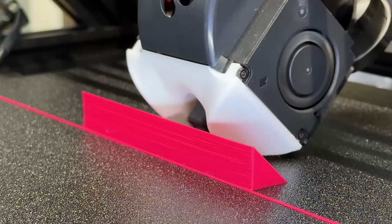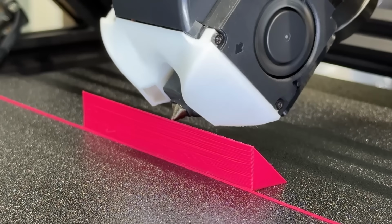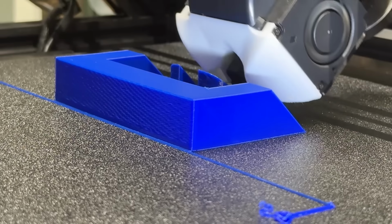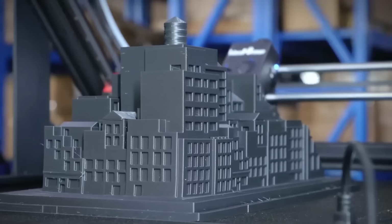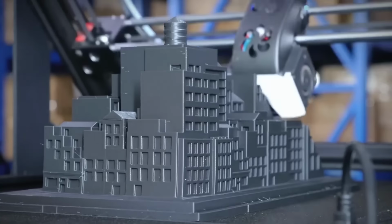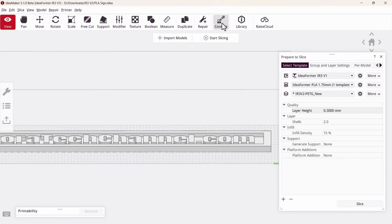2. The slicer profiles aren't well tuned, and since this printer prints at a 45 degree angle, I'm not sure if we can adjust the PLA cooling level only when it starts printing unsupported walls to help them stick better. I didn't notice the same issue with PETG, as I set the cooling to 20% for everything. I also saw one of the tests that IdeaFormer ran at their factory, and it seems to print straight walls with pretty good quality. I hope to see more well-tuned filament profiles ready to use when the final product is released.